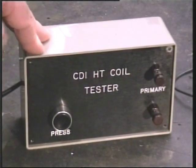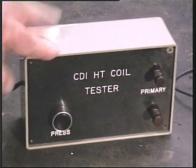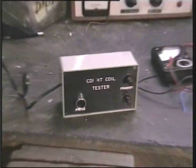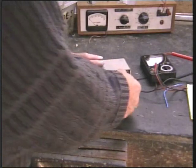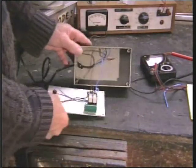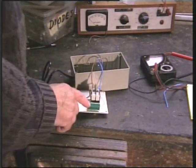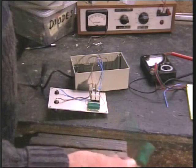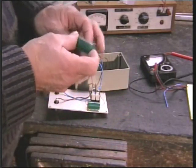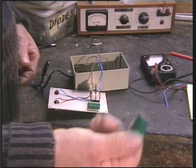And as I say it's quick and it's cheap. Well, quite honestly, not a lot inside - mostly air. Three components. A capacitor - there's our capacitor - one microfarad, 400 volt working. This one's made by RS, about 30p maybe.